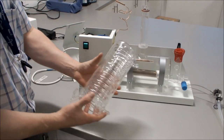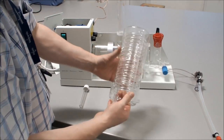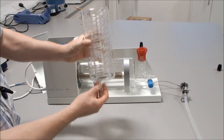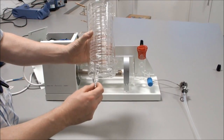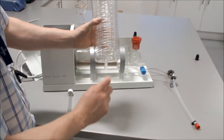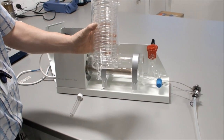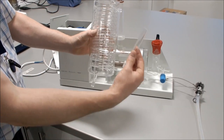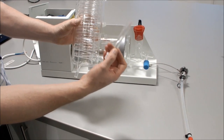Connect the condenser to the vapour tube. Before doing so, note that the condenser outlet faces the front. Now is also the time to connect your distillate output using 8mm or 9mm tubing, secured with a tie wrap — this tubing is not included with the kit. Before connecting the condenser onto the vapour tube, connect the condenser thermostat tube to the condenser.